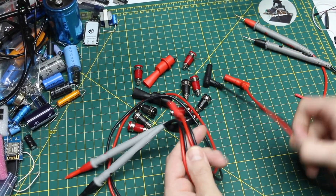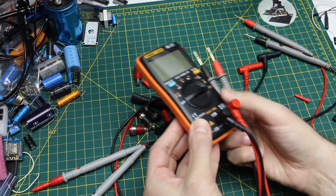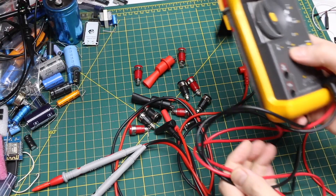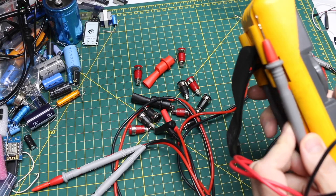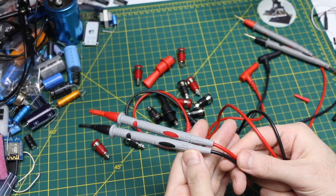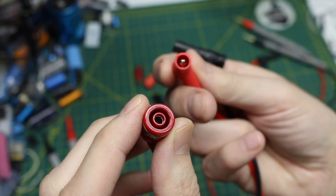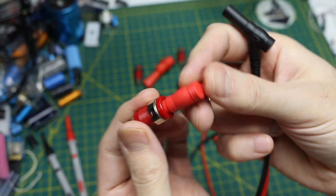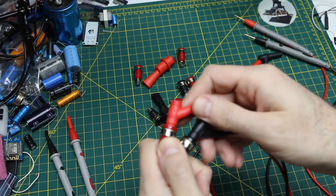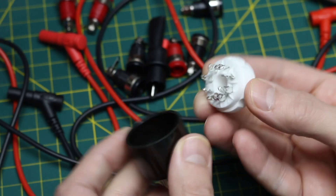Both of these are silicone, not the plastic type. I basically use silicone probes on any meters I can - they're easy to work with and hopefully temperature resistant if you knock a soldering iron against them. I have other ones of similar style but those are PVC, definitely not as easy to work with. I got these jacks which have banana sockets compatible with these plugs, so I can panel mount this - it's a lot safer if you have higher voltages.